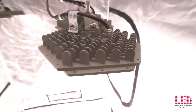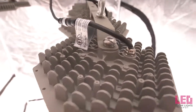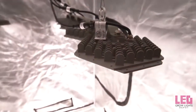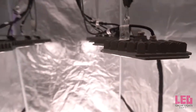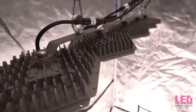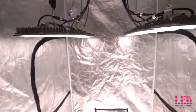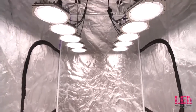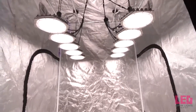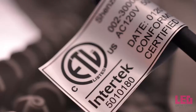The hanging distance is recommended at at least 24 inches. At closer distances, uniformity starts to decrease. Higher distances will lead to lower PAR numbers but higher uniformity. The uniformity and intensity can also be altered by moving the fixtures closer together or farther apart. The uniformity on this fixture is very competitive compared to other LED grow lights that have a very high center PAR reading but very low side and corner readings.